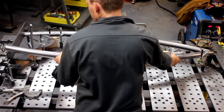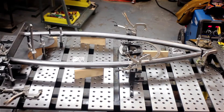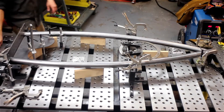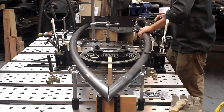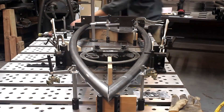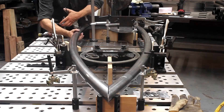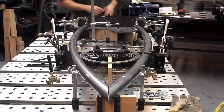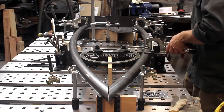Welding order is pretty important on a piece with curved tubing. I would do four or five tacks for the base of the tubing to the base plate, and then at the peak I would do three or four tacks — about two and a half inches of the seam at the inside of that joint where I'd finish weld — so that most of the distortion would happen while I was set up in the fixture.